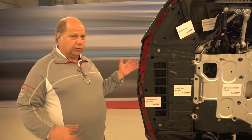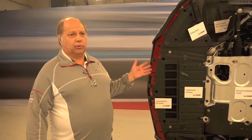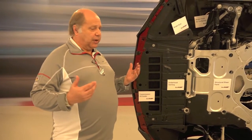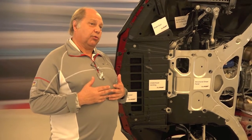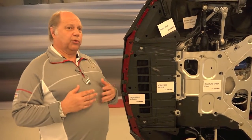Good morning. Now that we've generated all the heat, we've got to do something with it or else it's not going to retain power for very long. We've ended up going to a system that has a total of eight heat exchangers in order to keep all the elements cool. We start out with the engine oil — engine oil has to be dealt with first, and the primary function of that cooler is to exchange heat to the coolant from the engine oil.